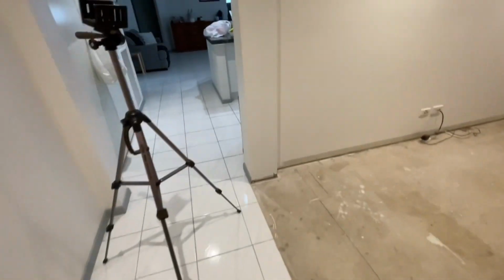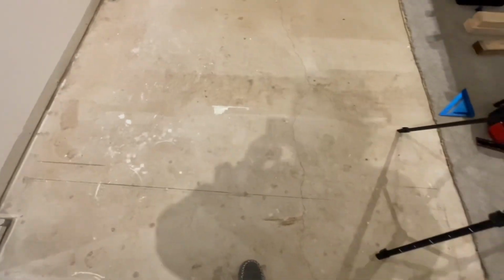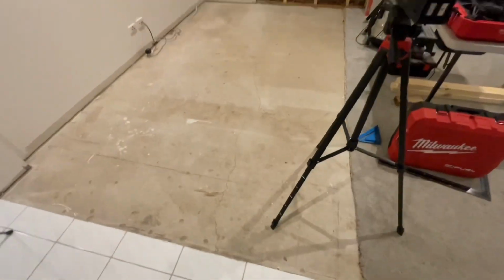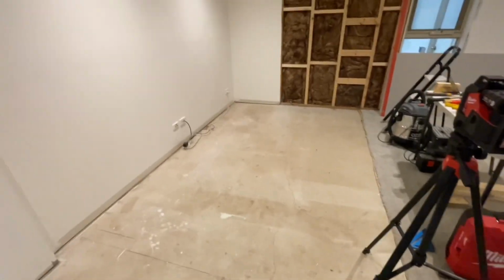So it looks like we've got a natural cutout here with this feature pillar. What's going to happen is we're going to do some stud work to pull that out to that line. And then it'll come across to here and we'll create another one of those pillars, which is this little rectangle you can see on the floor there. That's a little bit shorter than 400 deep, so if we push it up against the plaster in here, it should be inside this tile line, which is what we want, even though all of it will get tiled, but it will sit inside this line, so it won't protrude as we're walking past. So we won't run into it. We may even put a down light in the top to shine down on it, something like that. We'll see what happens. But right now, yeah, layout.